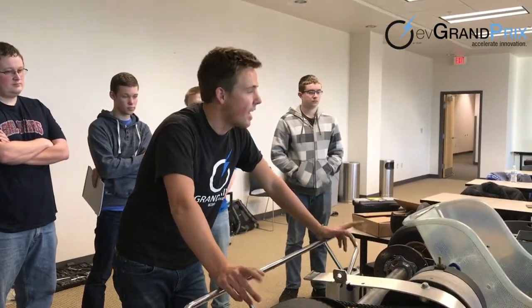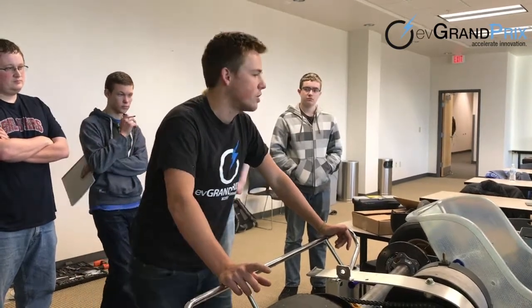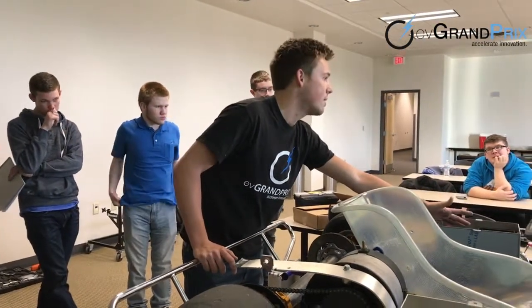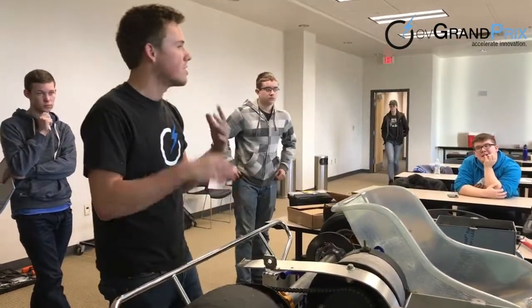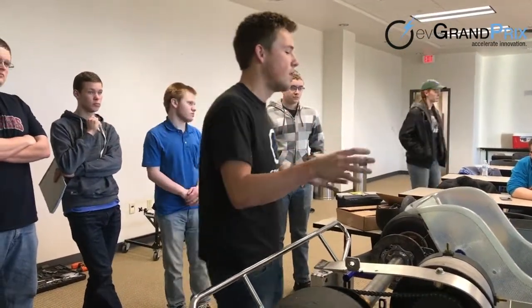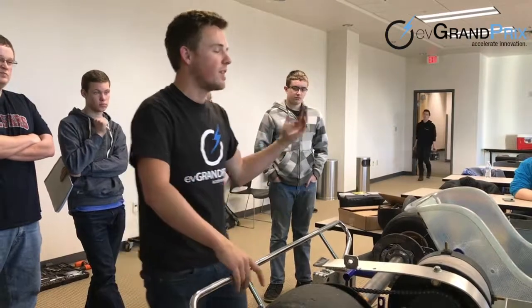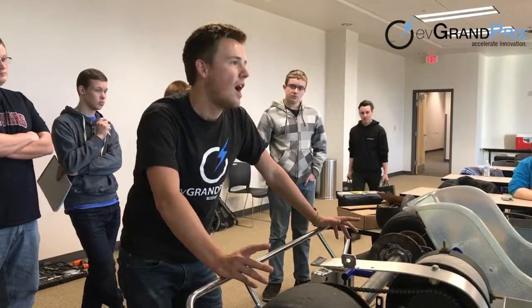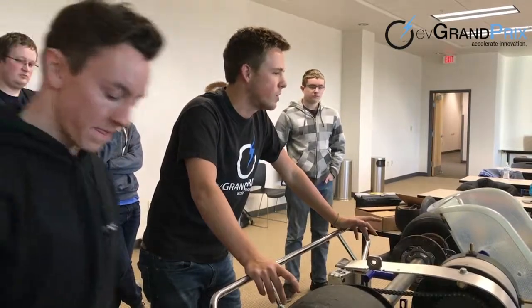Here are the downsides of lithium. First, it's more expensive. Second, you have to have a battery management system because each little cell has to be monitored. These 12-volt lead-acid batteries actually have six cells in them. Lithium batteries are managed at the cell level — you say 20S, meaning 20 series cells, which gives you a 72-volt system. You have to monitor all those cells with a $1,000 battery management system. If any one cell gets too hot or too low on voltage, you have to shut the entire battery pack down. So lithium is a little more expensive and more difficult.